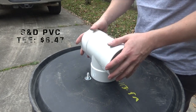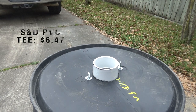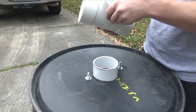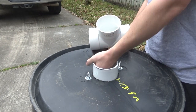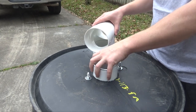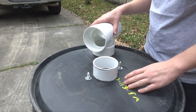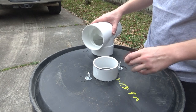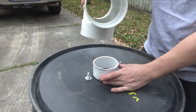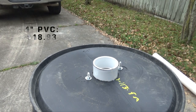The next thing you're going to want to add is a T fitting. As you can see, this doesn't really fit all that well, so I have a couple of options. I can either try and find a part that fits a little snugger, or I can put a short piece of four-inch PVC over the flange and then put the T on top of that and screw it in, since I don't think glue will work in this situation. I'm going to go with that option — cut a little piece of four-inch PVC that'll fit right over here.